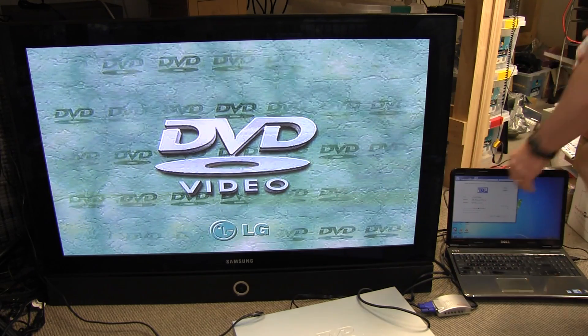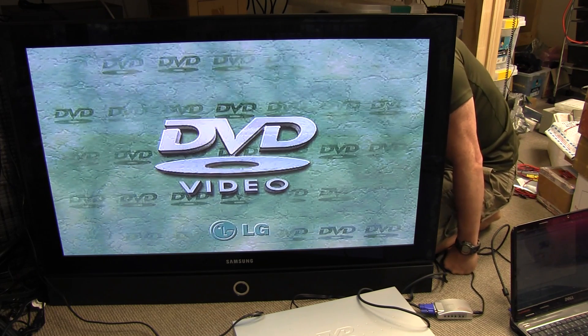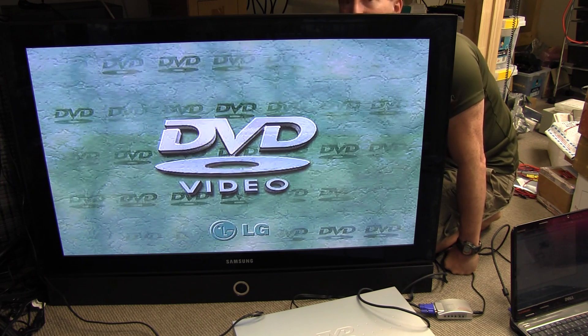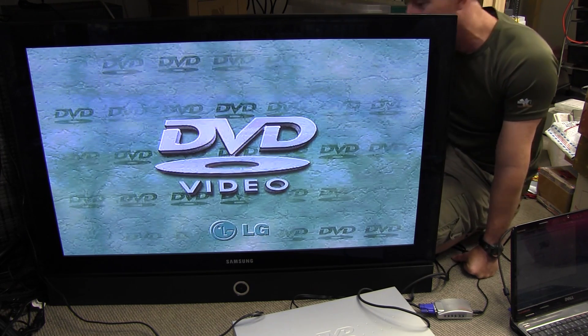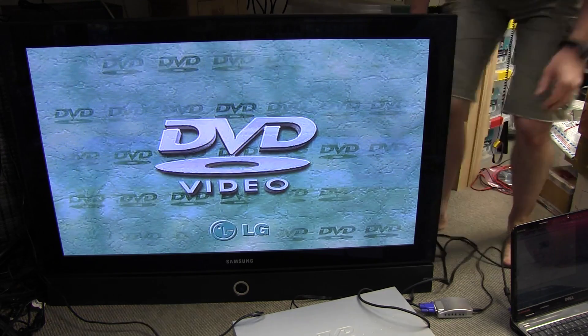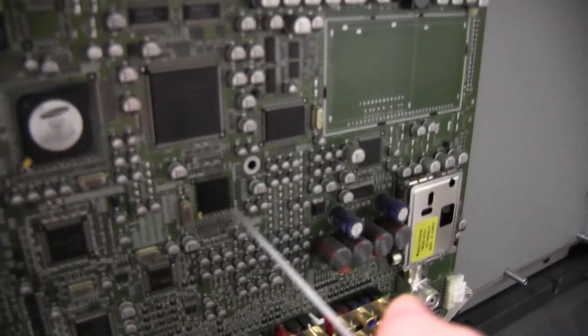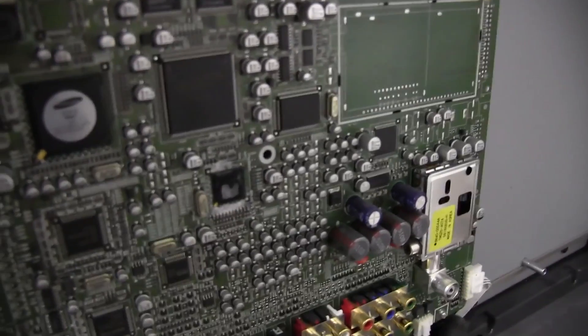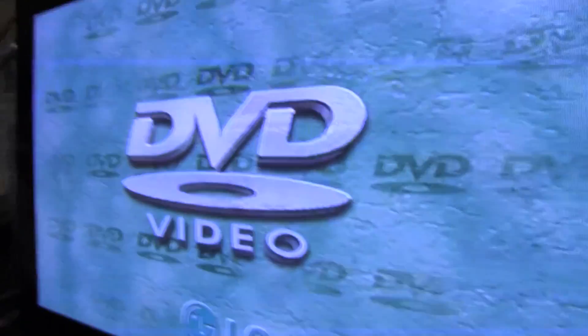Let's go. Let's see if I can get in here. I'm going to hit that BGA chip and see what happens. The chip's going all frosty. I've got Frosty the Snowman on that BGA chip and it's holding in just fine — not a problem. It's still cold. This is what it looks like when you freeze it — you get all the frost on the chip. It's nice and cold, and it's still working.